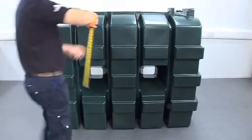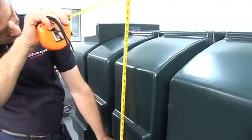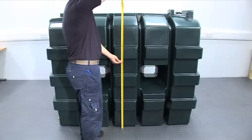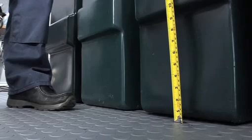The height of the tank can be measured using a measuring tape as shown. The measuring points are from the base of the tank to where the transmitter will be placed. Please take a note of the height. Make sure to measure the tank only, not the platform or base it sits on.